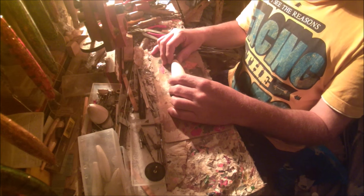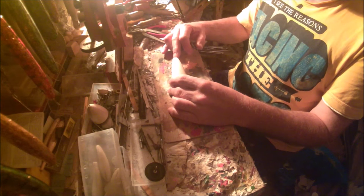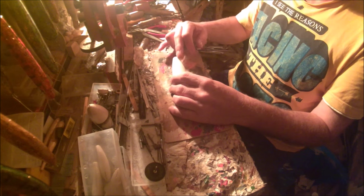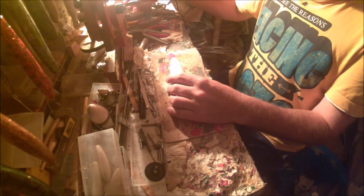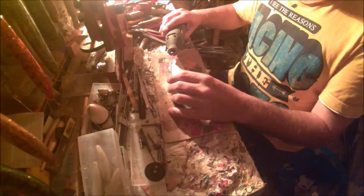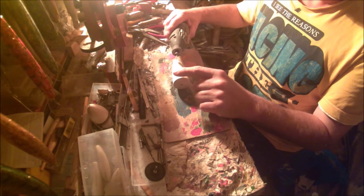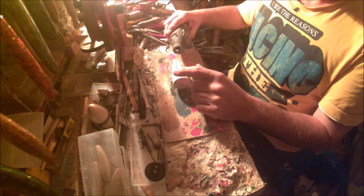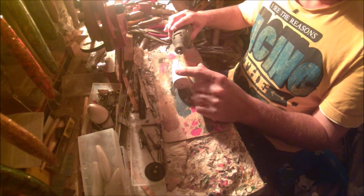Okay, before, you remember I used to drill with a 1.5 mil drill bit here and here, and then to make the holes pass through, I'm using a substitute drill bit of a piece of wire with the end beaten flat and ground the cutting edge to it.